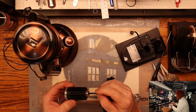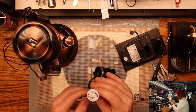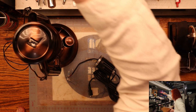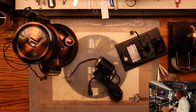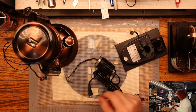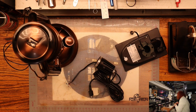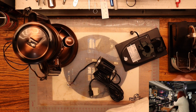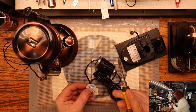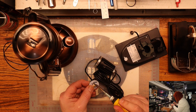We're going to push the wire through and desolder the LED board here. So we'll get the soldering station booted up. We're going to be desoldering on a piece of aluminum plate, so it's going to take a lot of heat. We're going to put the station on nuclear, and take these little pads off, because we're going to pull the wire out of the housing also.